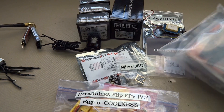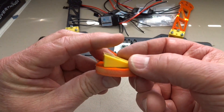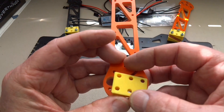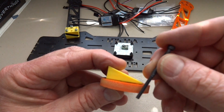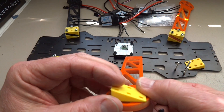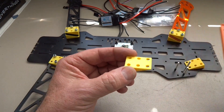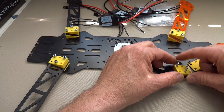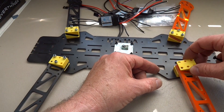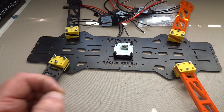Go ahead and get your instructions, tear your bag open, and let's start putting this thing together. A really effective way that the racing community has found to go faster is to put an angled wedge beneath your motor to tilt the motors forward, making it more aerodynamic when flying. The problem is that technique limits you to about 10 degrees, because if you try to go more than 10 degrees the angles just don't work out. I decided if 10 degrees is good, 20 degrees is probably twice as good. So I've put the wedge on the screws — you only have to elongate the holes on the arm to allow the bolts to fit through at a slight angle, and then put the wedge on top. All of the arms along with the motors are angled 20 degrees forward. That ought to give us quite a bit more speed.